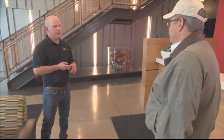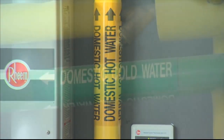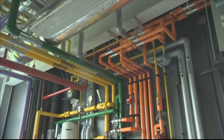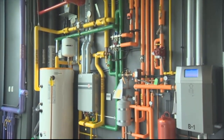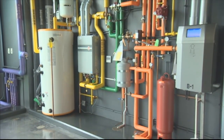So if that Legionella is present, the triggers are going to be temperature. If the water temperature gets between 77 degrees and 108 degrees, now it's going to start growing. And then the other two triggers are bacteria and organic material. So an old piping system, there's biofilm in there. There's going to be bacteria. There's going to be dirt, that organic material. So now with this shutdown, we're bringing in that temperature range as water systems are sitting stagnant and not being used. So cold water is not staying cold, hot water is not staying hot.